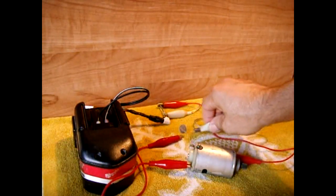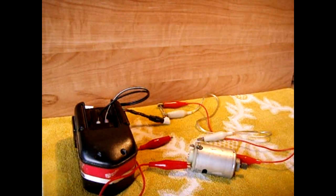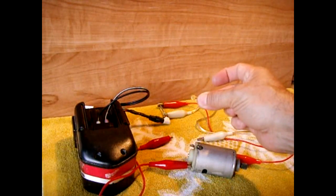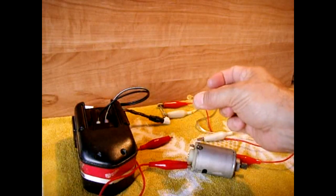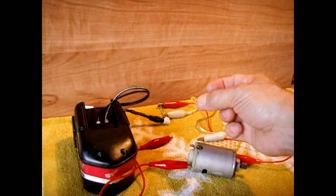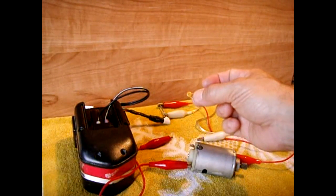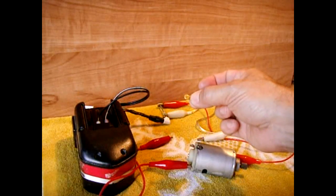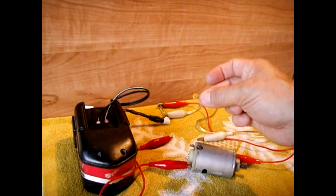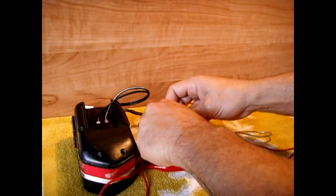PTCs are very similar to poly switches. This here is a poly switch — a PPTC — and it has an extremely low resistance. This one is designed for 72 volts at half an amp. You can put up to half an amp through this; once you exceed that, it'll heat up just like a PTC inrush limiter and disconnect the circuit. These are an excellent replacement for fuses. I'll demonstrate with this motor.